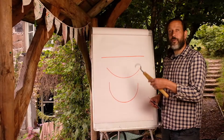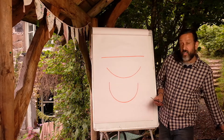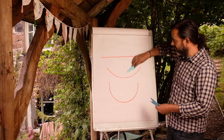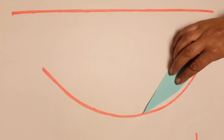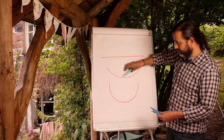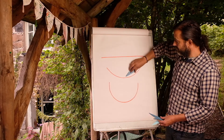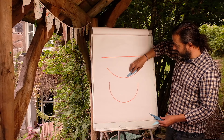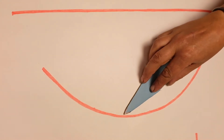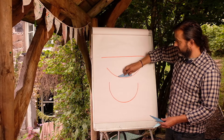Okay, so we've covered straight blades — now we're going to look at curved blades and hollowing. This is a representation of a spoon bowl — it's a bit deep for an eating spoon but for a ladle it's a fair representation. If you were to use a blade with a flat Scandi grind in a spoon bowl, you can see that the edge is either going to be digging in or it's going to be bouncing across — there's no way you can make a cut without chatter. If you were to use a Scandi grind with a micro bevel you could just about take a cut, but you've not really got much in the way of bevel support — there's no guiding action from it, so that's not really going to be a lot of use.